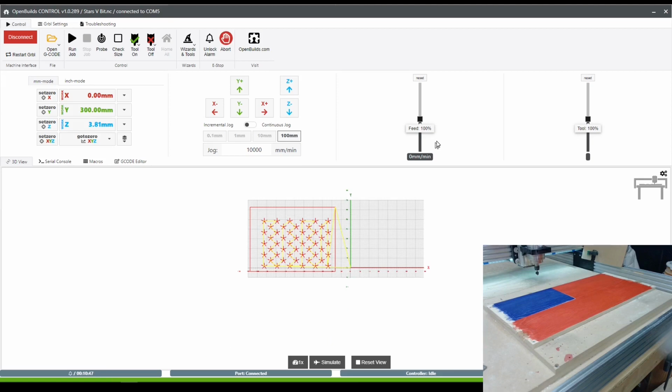All right, we are ready to send this one on its way. I haven't lost my 0 points here. That's what I ran it up from before. The machine's been turned on, holding position the whole time that we stained it, and our Z0 is lifted to its current safe height. And I did set the Z0 using the center point in here, so it should be good to run. All right.